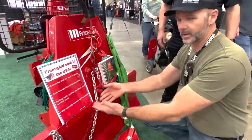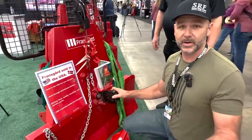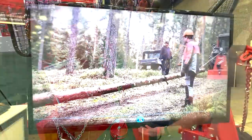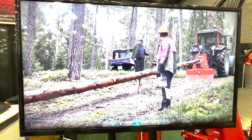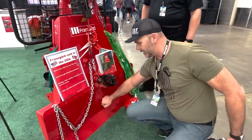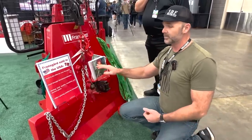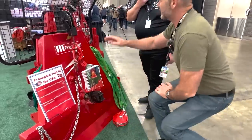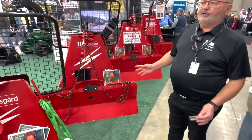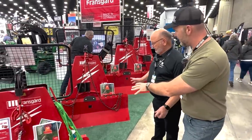These are choker chains right here. This is designed to pull your log out of the woods without having to take your machine into the woods — that dangerous situation where you could bump into a tree or have a widow maker fall on your head. When you pull your log up, it pulls it up here against this blade, which digs into the ground as you pull. So this digs down, pulls the log up, and once you get the log in place it's up off the ground — you're not plowing through the woods with the log. This smaller unit is for compact tractors, 25–35HP; this larger utility unit is for 35 to 65 horsepower with 8,000-pound pull.